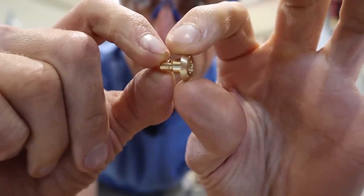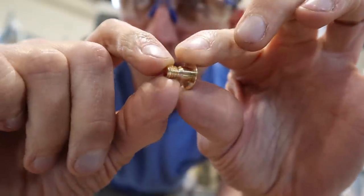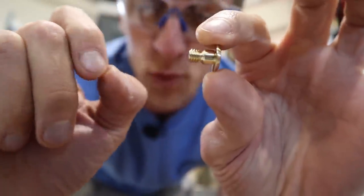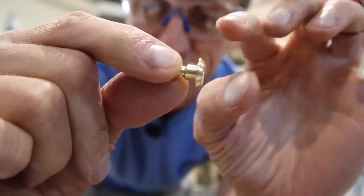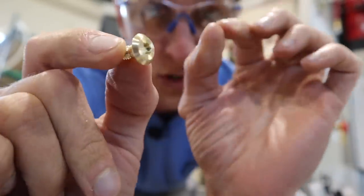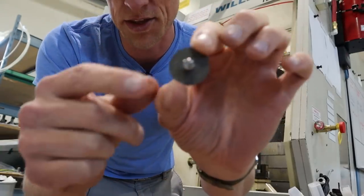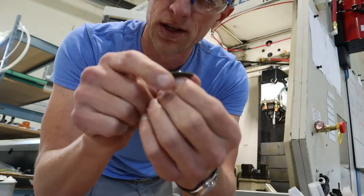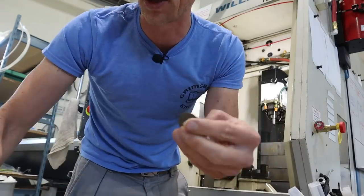So this right here is a brass test screw. We're going to do it in brass first so that we can film it — there's no oil and coolant everywhere. It's a relatively straightforward screw, but it's got a very thin head, a very fat diameter head, and a Torx Plus pattern milled into the bottom that's only 60 thou deep. These are the grinding wheels we grind all of our RASC blades with — one inch diameter, 60 thou thick — and this is how we attach it.